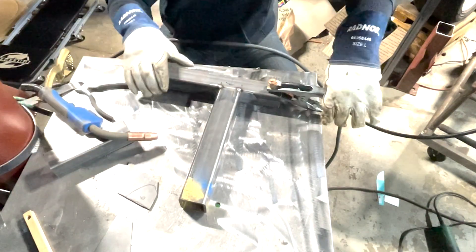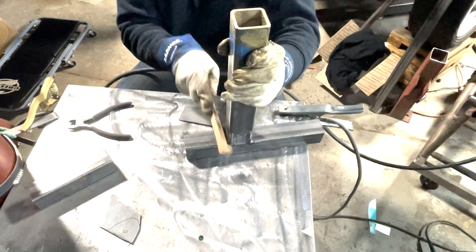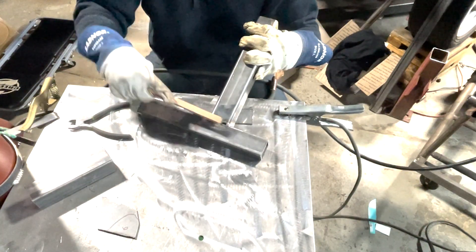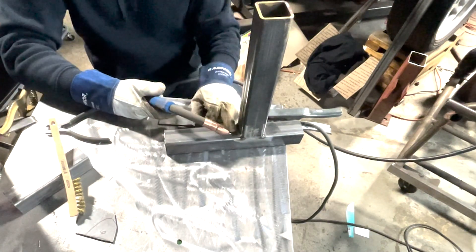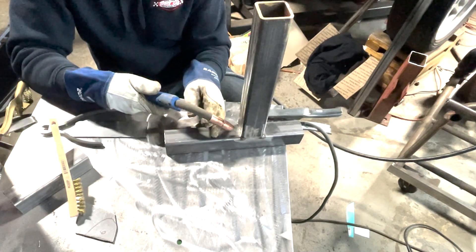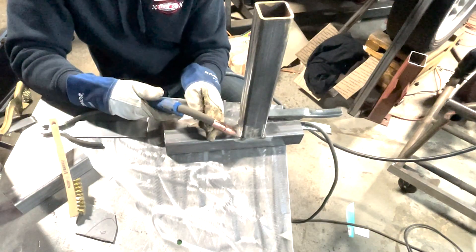Don't forget to snip your wire before each tack — do the same thing every time. I also keep a wire brush nearby so that after each tack, I can knock away any dirt or contamination that gets pulled into the heat puddle. Now we're going to run across here and fill up the V — it's a great way to practice on something like this. Get comfortable where you can see your line, plan your path before you go, and maybe rest some fingers down to guide your direction. In this instance I'm going to pull the torch, and let's give it a go.